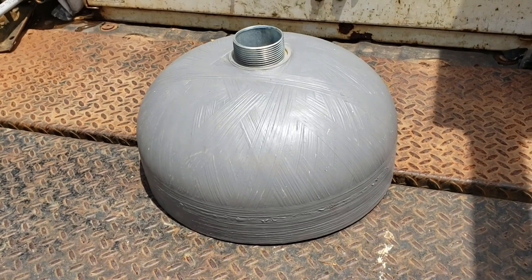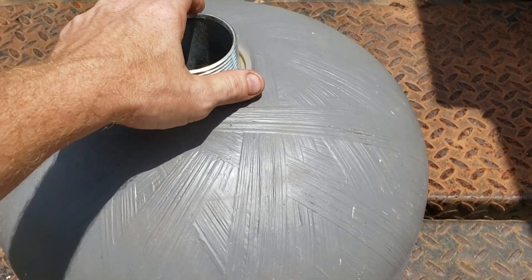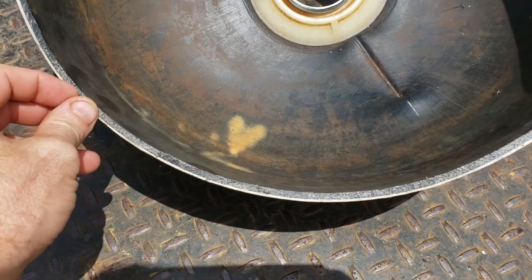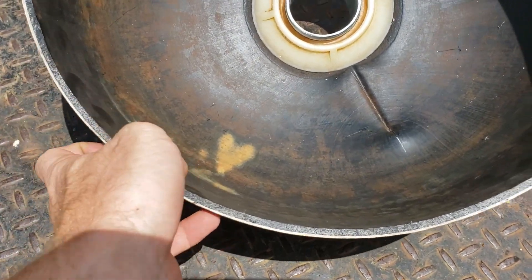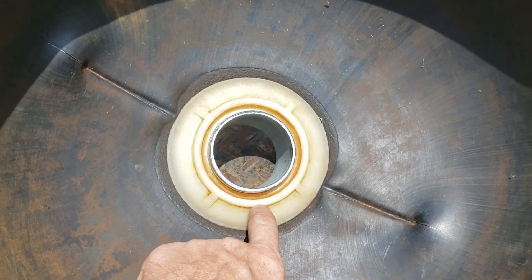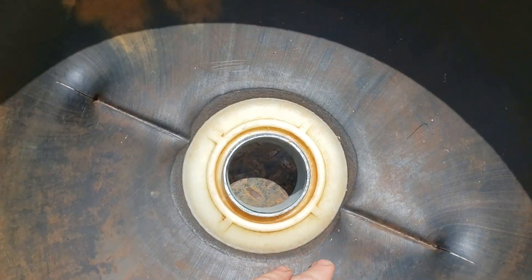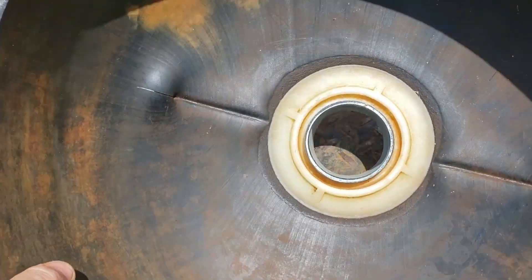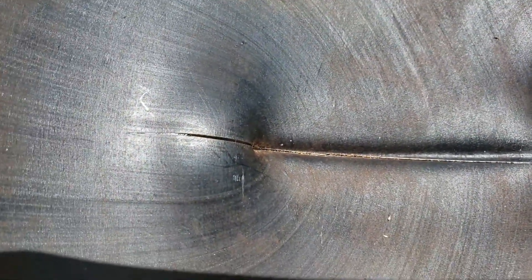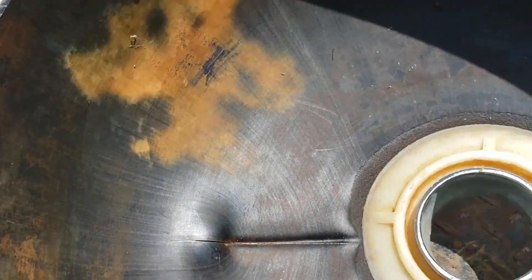This is actually a fiberglass tank that's been converted into a filter funnel to fill up filters — it makes good use of them, a second life. But this is the o-ring groove that used to be on top of the tank — you can see where it sits right there. Fiberglass on the outside, your black poly liner, and this gel-coated bond thread here. One of the main problems with these tanks failing is this bond actually bonds together to the plastic and it fails there. There's also another place — see where they pinch the poly together to close up the end? You can see that crack right there, and that's where all the air leaks out of the tank.